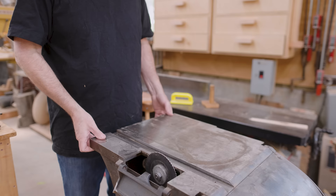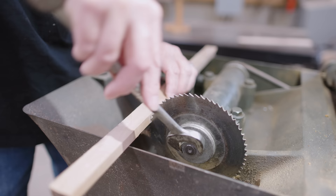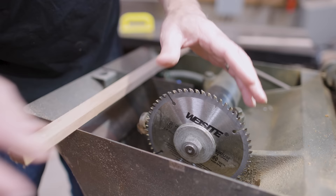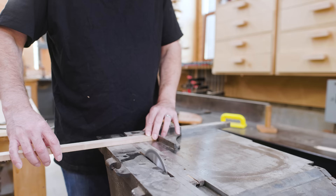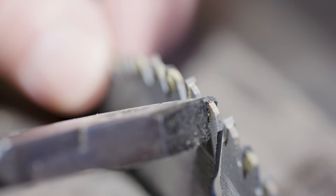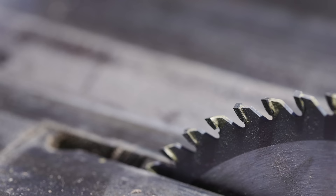The first thing I thought of was to get a new blade for the saw, so I took the old blade off. It takes a saw blade with a 7/8 of an inch arbor and about a 6-inch diameter saw blade. I found something that looked like it would work, ordered it, and put it in the saw — and the first cut was horrible. It was chattery and didn't leave a very good cut. I found an extra carbide tooth and pulled that off, but the tooth next to it was in the wrong place, so it still didn't cut very well. I put the original saw blade back on again because that seems to cut a lot better.